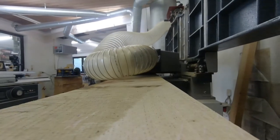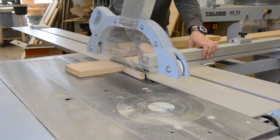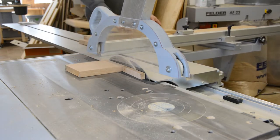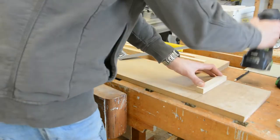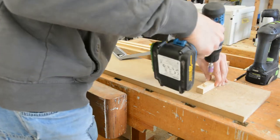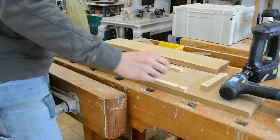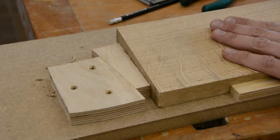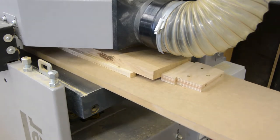With the jointer and planer I square up all sides before cutting them to their final dimensions on the table saw. As the front seemed a bit heavy I decided to add a taper to the front. You could remove the material on the table saw but I feel safer building this quick planer sled — the pieces are secured with a wedge and sent through the planer a few times.